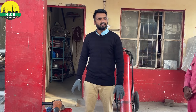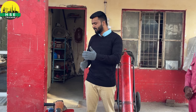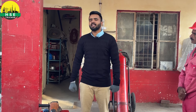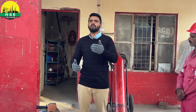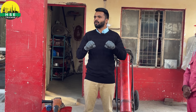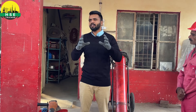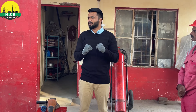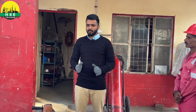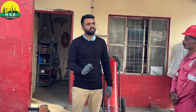It is especially difficult when the grip is not proper — the person gets tired. For someone who uses the grinder for 15–20 minutes, fatigue sets in and posture changes. If you see someone working and they appear tired or their position is not correct, stop the work, take a breath of one minute, then start again. Always keep the grinder level with your body — do not raise it above your body level. If it slips from up there, you lose control. Maintain a correct, balanced position.